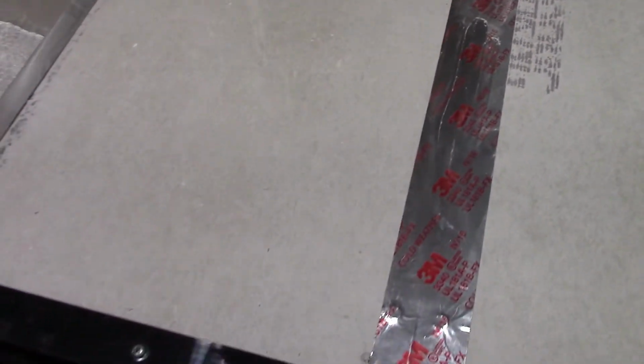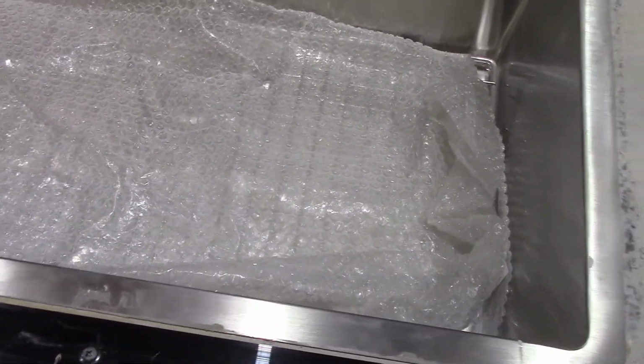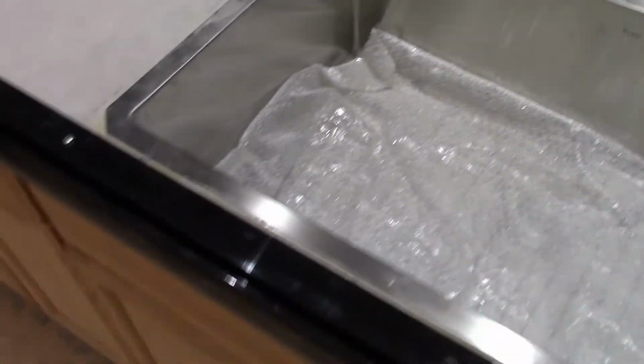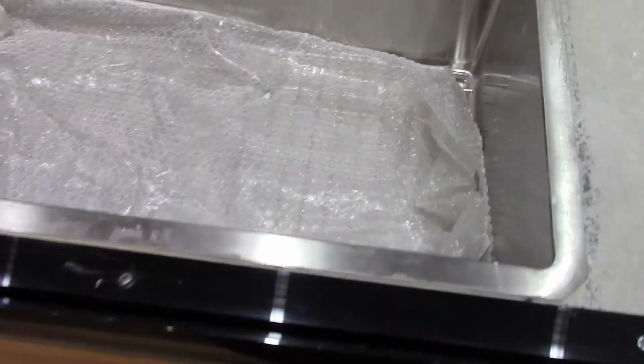We're going to vacuum this whole area out real good. Then we're going to start putting our sink form in. What we have to do is we've got a piece of plastic that'll fit in here, and will rise up to the same height as this. So we'll set our level across there, and then I'll use a heat gun to soften it and fit it into the corners there, and that's how we'll have our barrier around the sink for the concrete.